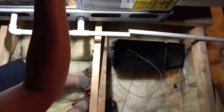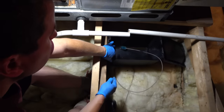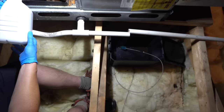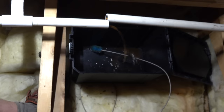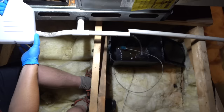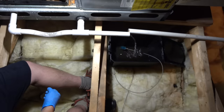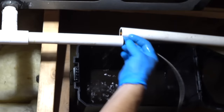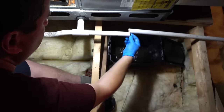After pushing the brush in a couple more times, I'm going to take a gallon of water, put a bucket under the drain line, and pour the water into the pan on the air conditioning system. This simulates the water coming out of the air conditioner, and you can see really dirty water coming out of the line. You don't have to open the air conditioning system to do this — you can just do the cutting and use the brush — but pouring water in is an easy way to confirm the line is cleaned out.